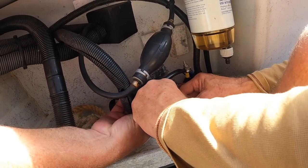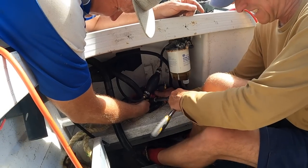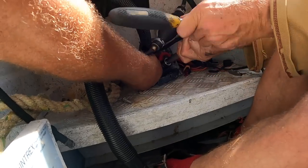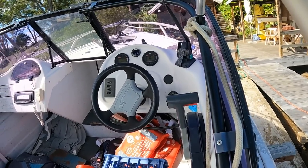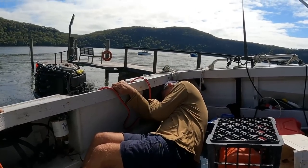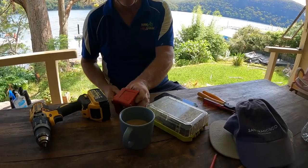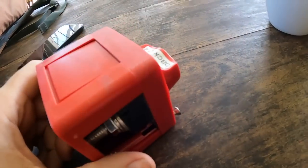Just going from two posts to one post — let's get that a bit straighter. Look at that — we've got dash lights now, straight away. Bad battery switch. There you go — fixed. I'll have a six-pack, Kevin will have a new Ferrari. Remember: even though it had a house sticker on it, it's actually a starting battery.